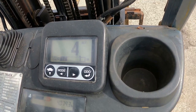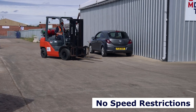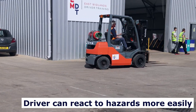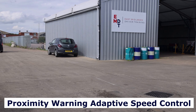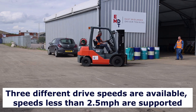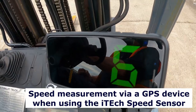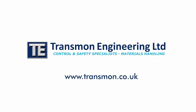In the following video you can see that the truck has no speed restriction as it comes around the corner to the opening of the roller shutter door. In the next shot the truck is restricted to 5 miles an hour, and in the next shot here we have adaptive mode, using one of the zone inputs to detect the pedestrian. You can have up to three different speeds. I hope you found this video useful — thank you for watching.